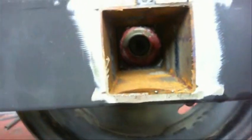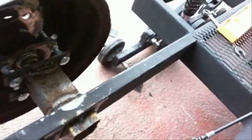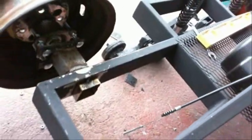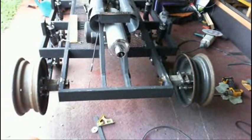The next thing I have to do is figure out how to attach the drive shaft to the bearing assembly. As you can see inside here, there's a nut on the end but it's clamped in place so it can't come apart. So I'm going to devise a way to connect the drive shaft to this — this is what's going to spin the drive wheels. On the other side, I'm going to mount a bearing holder that the other side of the drive shaft will fit into, so on each side there will be a bearing holder that will secure the drive shaft in place.